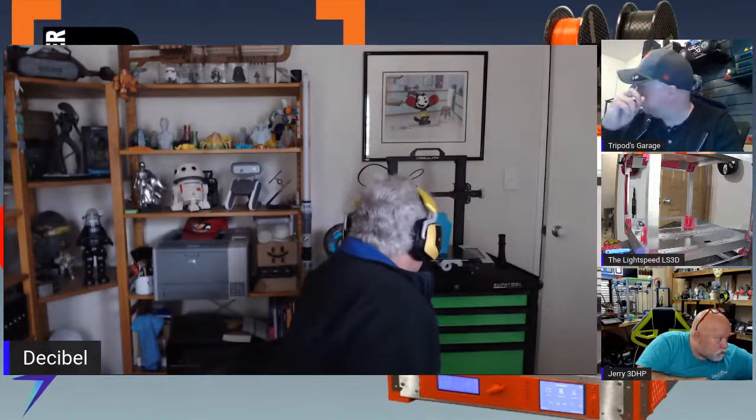And I just got my first long print done with the Micro Swiss hot end. It literally just finished, waiting for it to cool off. How was it? That seems fine. I thought I'd trashed it though when I took it all apart and put it together again. Went straight forward, put all the stuff in, turned it back on again, and minus 15 degrees on the hot end. Oh yeah, the thermistor. I thought I'd screwed in and cracked the thermistor. So I've got a spare hot end assembly. Pulled the thermistor out of that, plugged it back in, turned it on, minus 15 degrees.